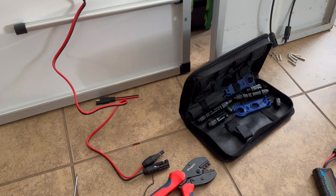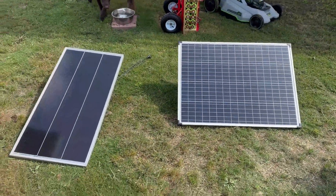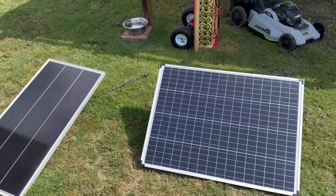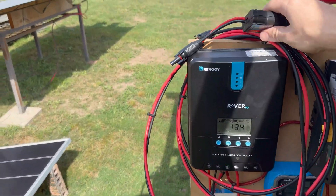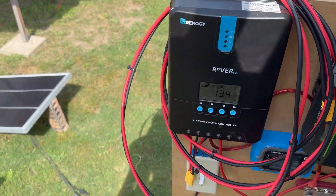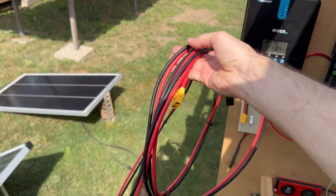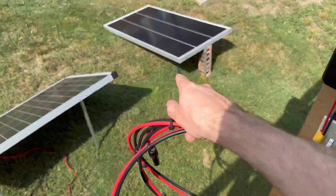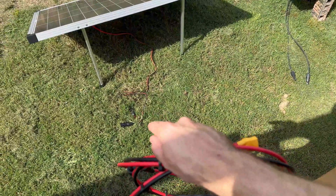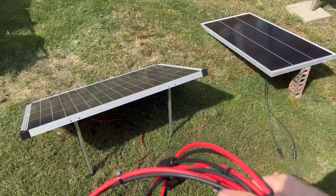Now we have both solar panels outside. I don't know how good this test is going to be because we've got a little bit of cloud cover, so I'm going to try to wait for as much sun as possible. This is the rig we're going to use to test the output — I got the power meter set up, and I also made this panel connection cord out of actual PV wire, so it's weather rated. I will say, if you're going to use the Harbor Freight panel outside a lot, it has tin copper wire instead of actual solar panel wiring like the Wheezy has, so keep that in mind because it might corrode. The Harbor Freight also has a little stand; the Wheezy does not.